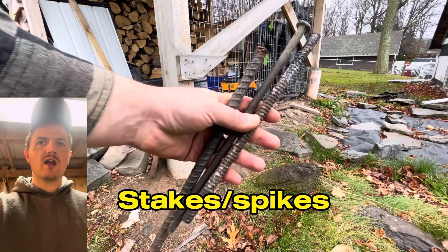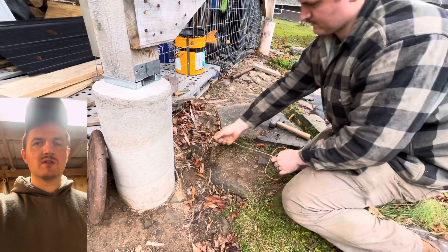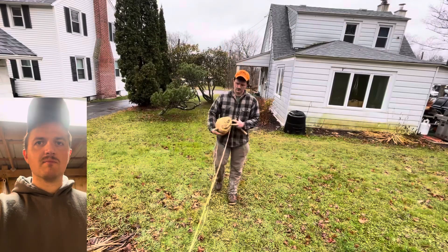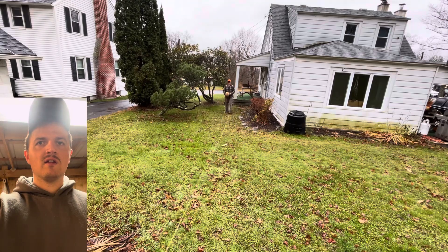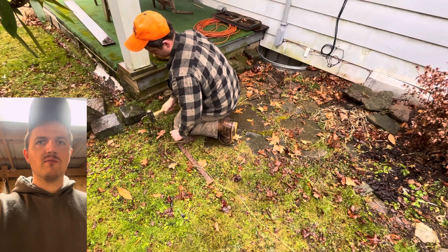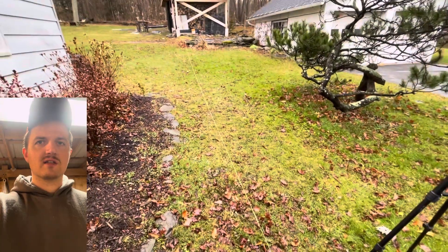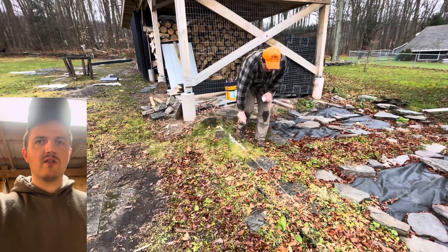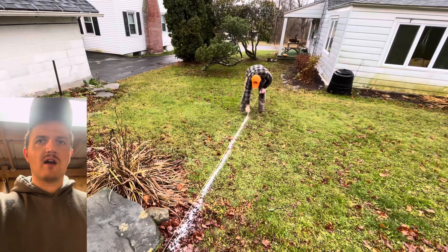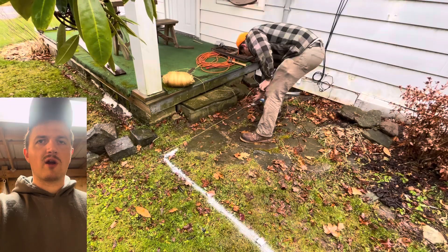The first things you're going to need are a hammer, some metal spikes, spray paint, and some bale string. First thing I'm doing is marking the line at which I want to dig. This is about an 80-foot electrical burial from the house to the barn. I'm using a framing square in the corner to make sure that my angle is 90 degrees, just to make it easier for the pipe fittings. Then I go along and mark my burial line with spray paint.